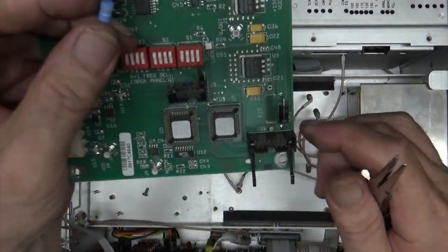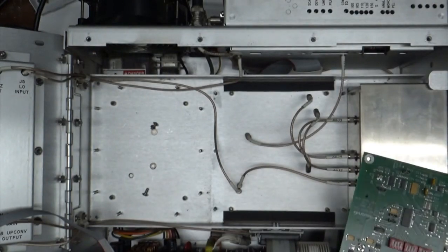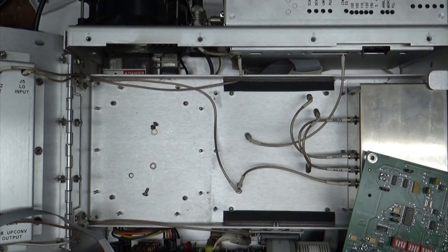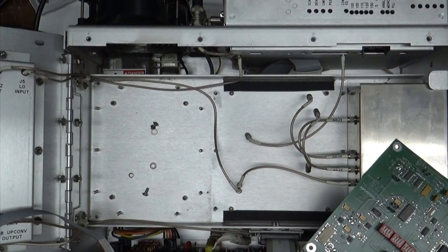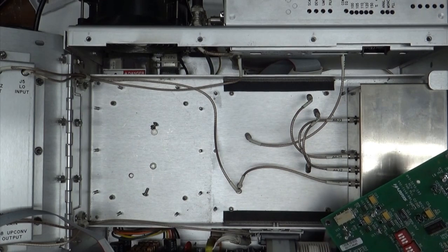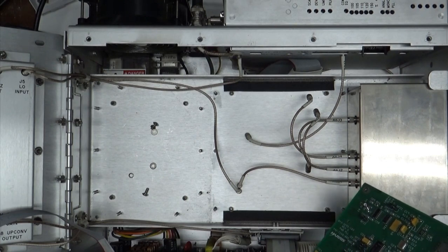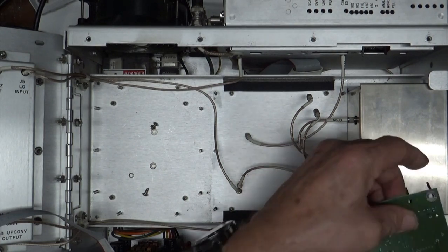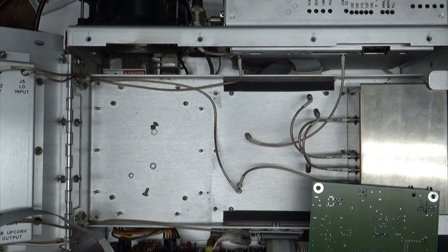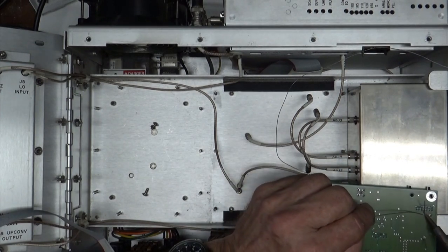It got a little toasty right there. All right, so we'll take this guy, stick them in here. This is for a customer. So I'll ask him if kludging it together is good, if he's in a hurry to get it back. If not, I will order a 47 ohm 2 watt resistor.